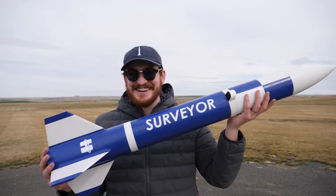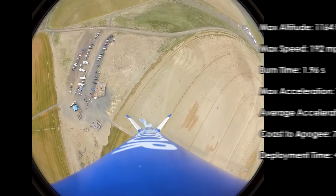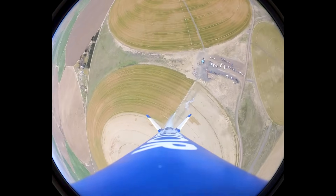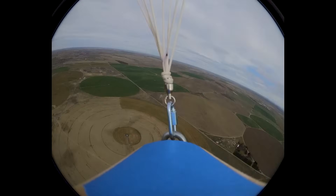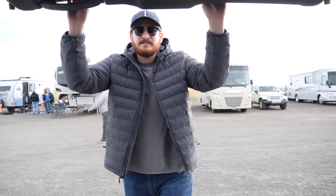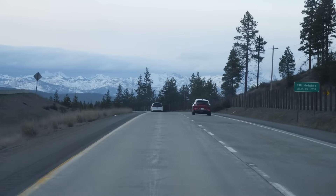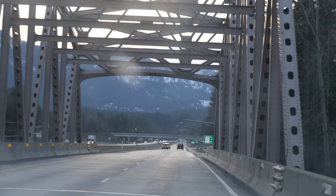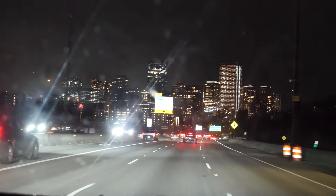It was a beautiful flight — dead straight on the way up, almost no spin. There were a couple of excruciatingly long seconds late on deployment, but once it did fire the parachute opened almost instantly. Watching the footage back frame by frame, there is a sketchy moment where the shock cord wraps around the parachute and leader lines — caused by the late deployment where the parachute was pushed ahead of the booster and then the booster fell past the parachute dragging the shock cord around it. I'm super lucky this didn't get more tangled, but I have a couple of changes I can make in the future. I'm super stoked this went so well and I'll definitely be back with more projects and maybe a level 2 certification. If you have any ideas for things you want me to try, let me know — there's a ton of room for new features and improvements. I'm Con Hathi, and I'll see you in the next video.